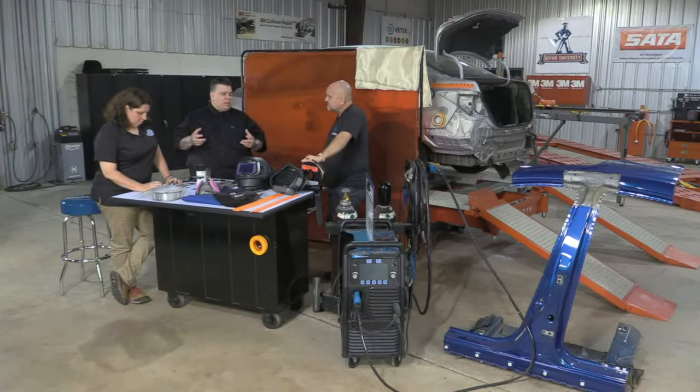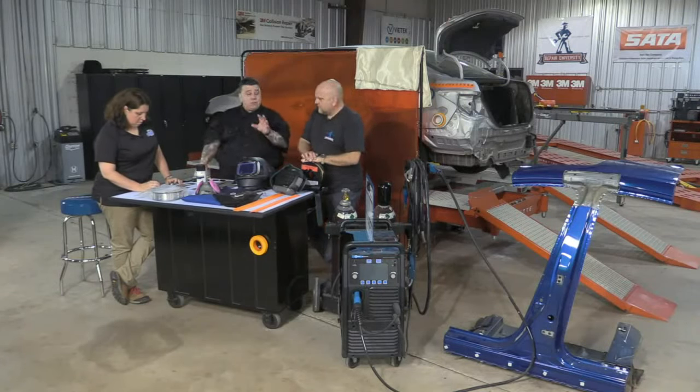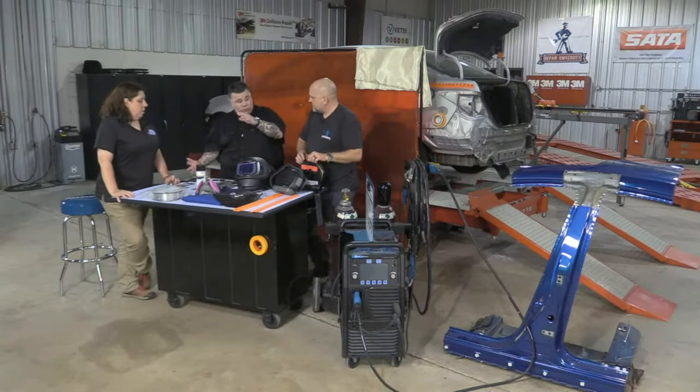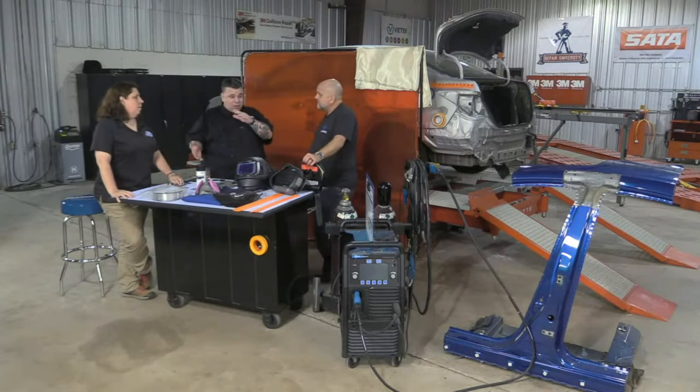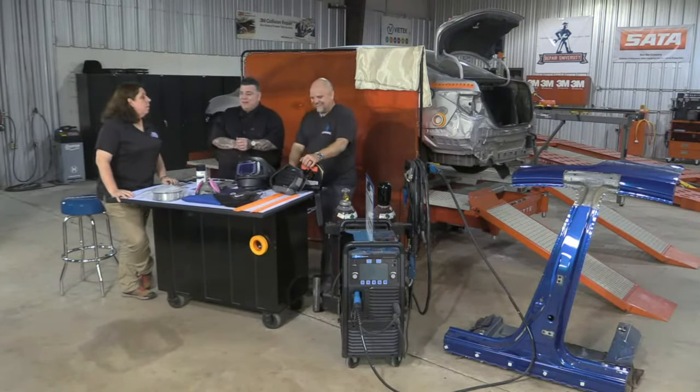Most of the resistance welders you should have are cooled to the tips. You can clean the tips, and you might be able to shorten them once or twice, but most of the time they have to be replaced a lot. So keep those copper caps, because you get a whole 55-gallon bucket of them. They can make money. Buy barbecue for everybody.